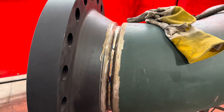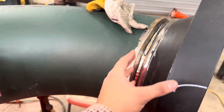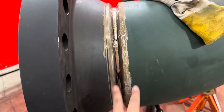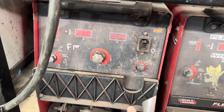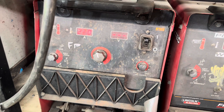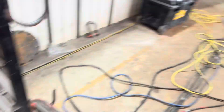Once you throw that pass at 200 with the 1/8 rod, you're able to take off the XL cup - just use a regular 10, or whatever your preference is - and start free-handing. I like to throw one more big wide pass and then two stringer free-hand passes. For the fills, since it's in position, run at 220 to 230 amps. If you're on a rollout by chance, you can use 5/32 at 300 amps as long as your rig can hold that. Since we're in position and I don't want to bend the flange, I'll be going at 220 or 230 - whatever you feel comfortable with, as long as it's not too cold, so you can fill up the pipe a lot faster.